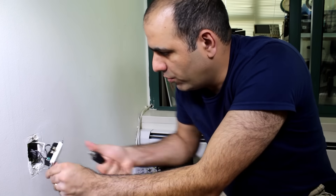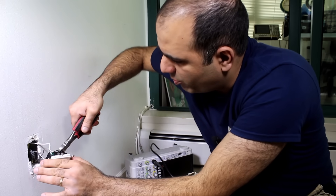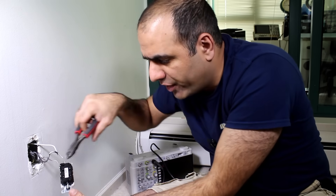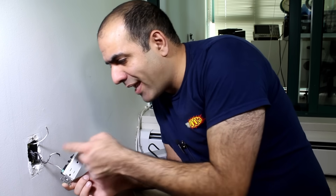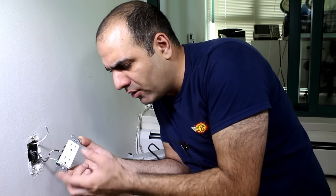The white wire was neutral — I connected it backwards. Remember to read where to plug the black and white wires from the back of these outlets; it's written right there. White wire is neutral, connected to the wider slots. Black is live, connected to the smaller ones. And earth ground is connected to the semicircle holes.